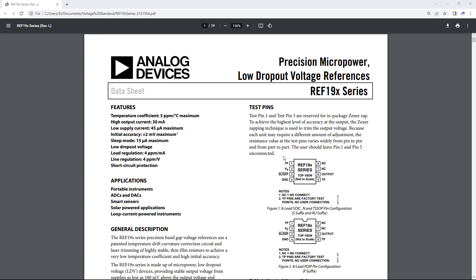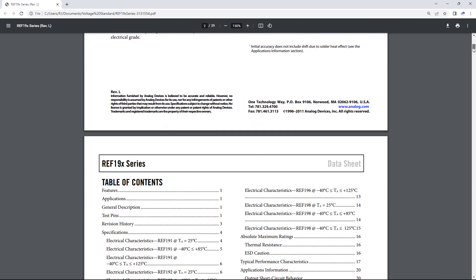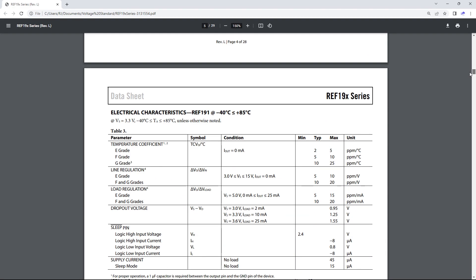Here's what I've got in mind. I've used this Analog Devices REF-19X series in a project I did earlier where I built a ham radio 600-watt amp, and my control board needed a very accurate reference for its analog-to-digital converter to measure power output, SWR, and such. For that reason I used one of these chips to get very accurate reference voltage — they come in different voltages. My thought is let's just run one of these REF-195s as our method of generating our reference voltage. They're easy to use, very low part count, not that expensive.